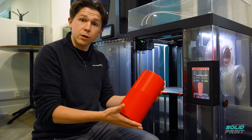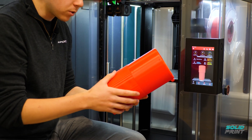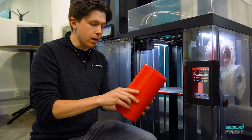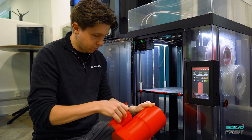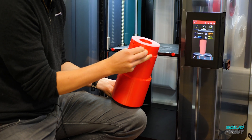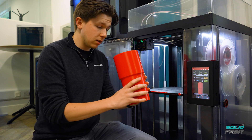With the part itself we can get an idea of the volume this beast can reach. I've used standard regular supports, which are the same material as the rest of the print. With the Pro 2 and its two nozzles, we could use different materials — such as a breakaway material or PVA as the support — but for this test print we kept it simple, so the supports just break away by hand. I might want to clean it up a little more with some pliers later, but as a rough cleanup you can see how nice that surface finish is — basically no scarring whatsoever underneath the support material. Really decent part — I'm excited to use this for even bigger prints in the future.